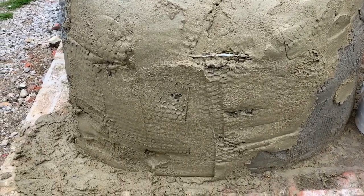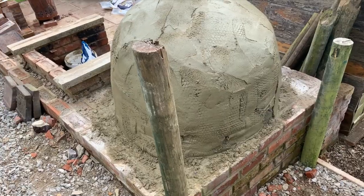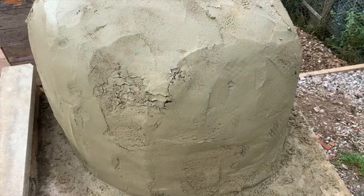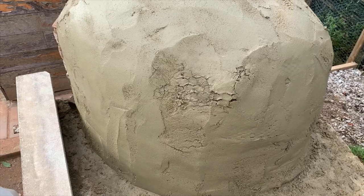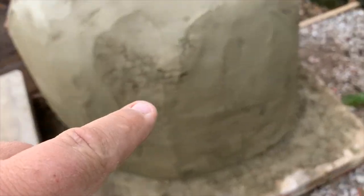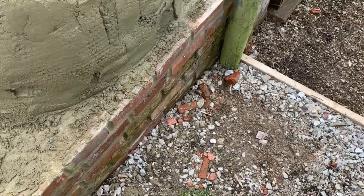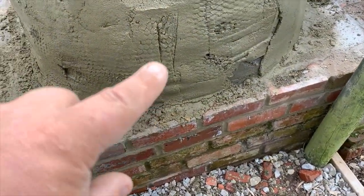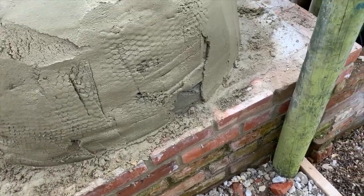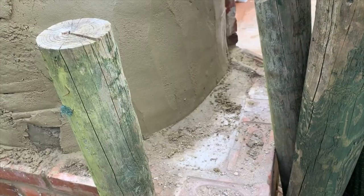You can see it's sunk down but I'll just let that go off and fill the crack tomorrow on the next coat. Back in a bit — sorry, I'm knackered, it's hard work. All right, so it's all had at least one coat of render on the front bit, which has had two coats — it's a lot firmer. But you can see the chicken wire just poking through where it's only had one coat, but that's fine — it's just to get that first layer on to make it rigid enough.